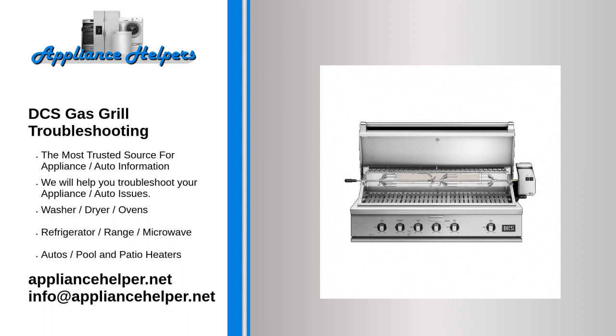The tank. Modern propane tanks, mandated by the government, contain an overfill prevention OPD device. This makes it so a propane tank cannot be overfilled. Rarely, the OPD on your propane tank can be damaged, causing the tank to work incorrectly.